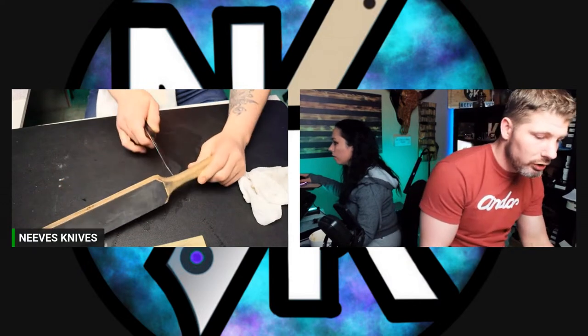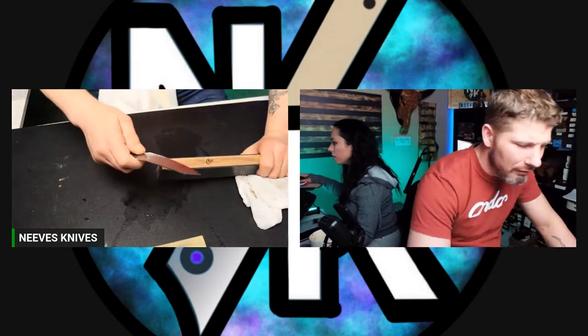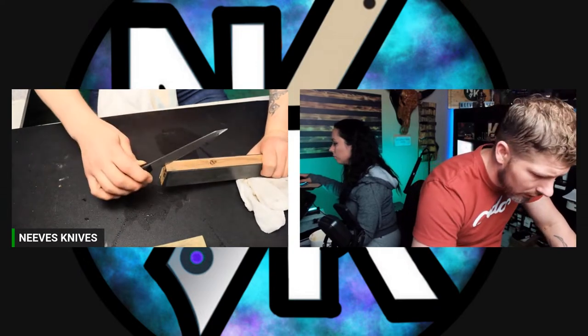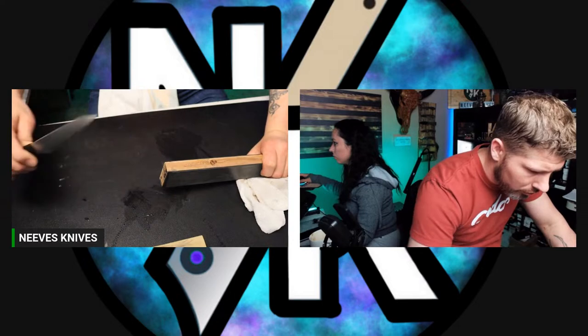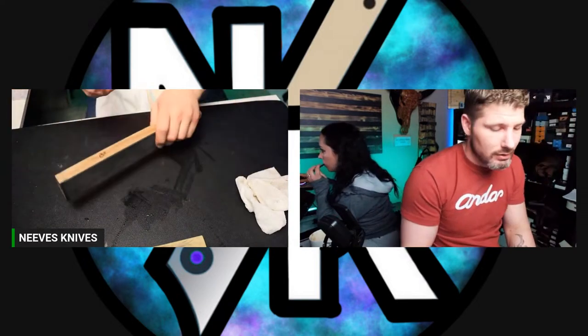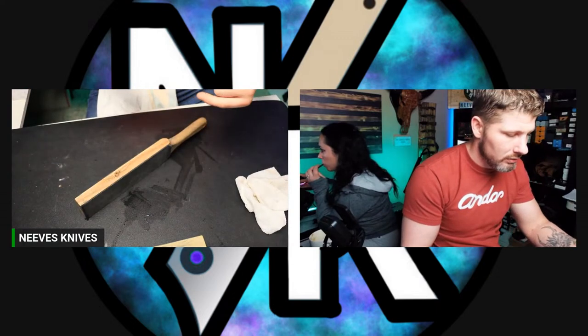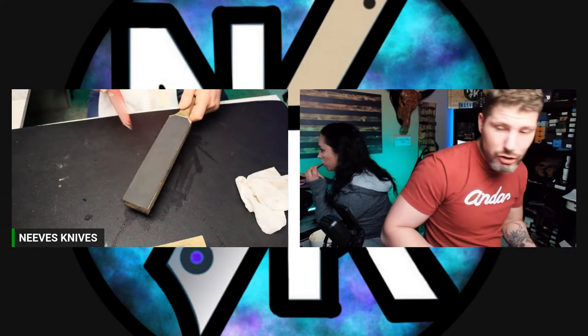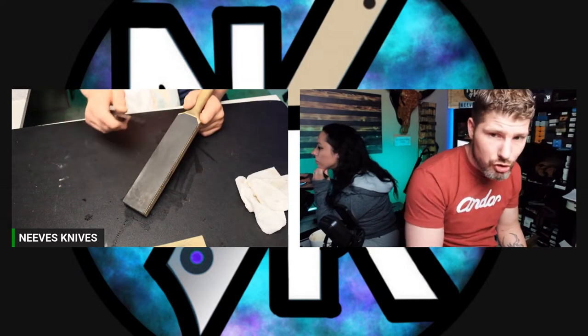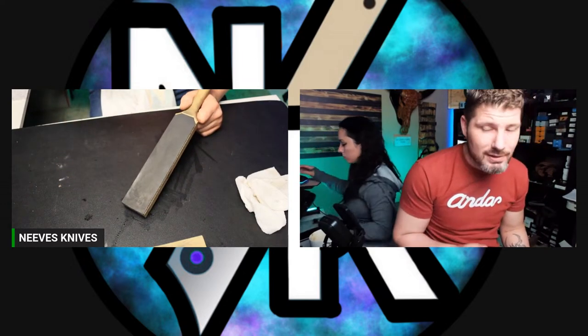So really quick, what I'm gonna do, it's not gonna get posted or anything. I have a little tiny bit of burr that's being a little stubborn, so I'm just gonna take this corner of this wood and draw this through it three times. One, two, three. That's it. See if the burr's left. Feels like it's gone. So that's a trick for you guys that don't know: if you have a burr and it's being stubborn, draw it through some wood three times.